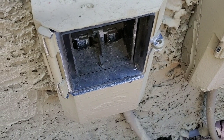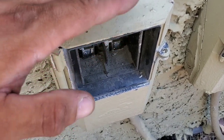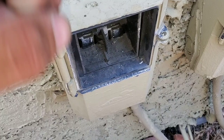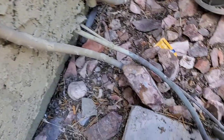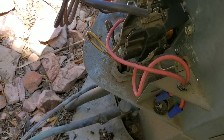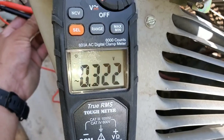Before starting on the wiring to your contactor, make sure that you remove power by removing or turning off the disconnect, turning off the breaker, and then go ahead and test the incoming voltage at your contactor to confirm you do not have voltage.